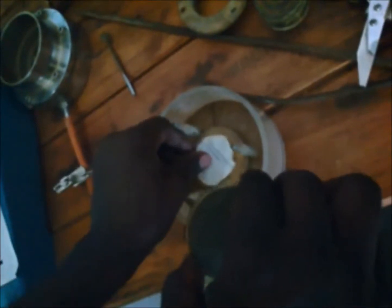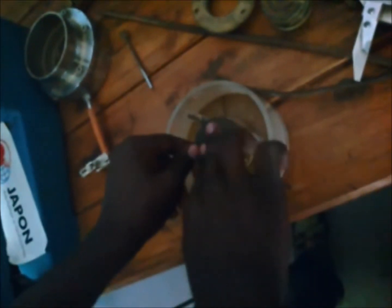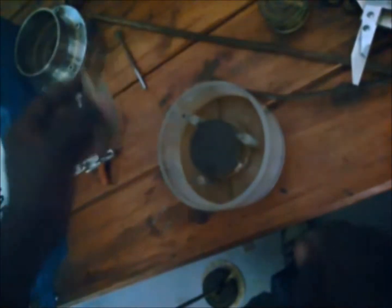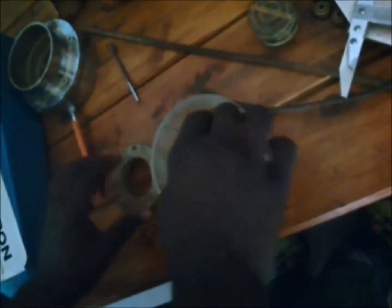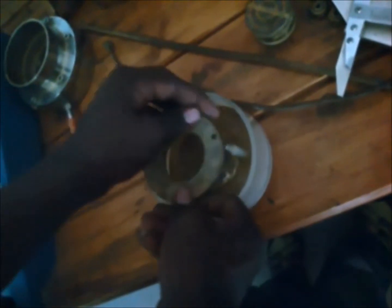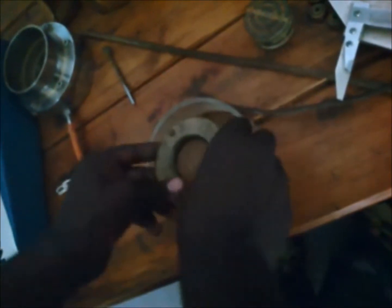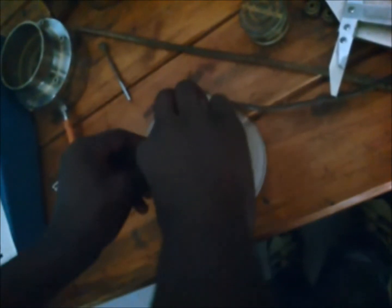The ring is placed over a gasket rubber and porous stone. At its top also it is confined with a porous stone. Finally, you put the guide link, which is to be fixed firmly by the use of bolts, so that there will be no unwanted displacement of your specimen.